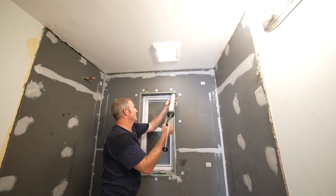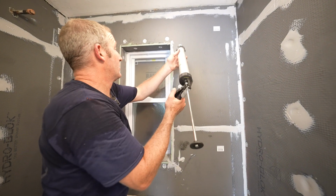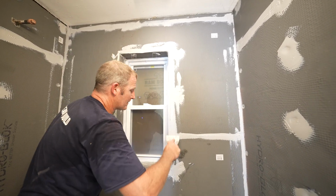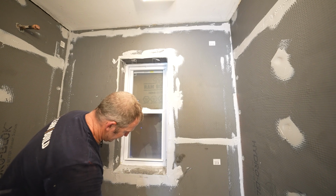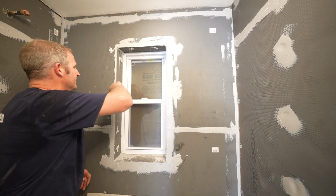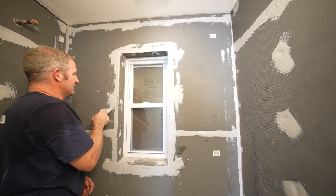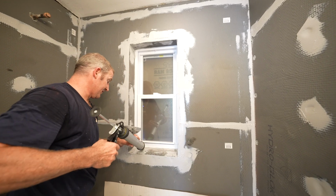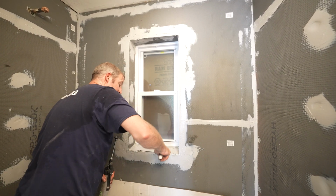Okay, so then around the window, just go across this entire seam. Make sure you get these little... And again, if you have any of this green exposed, it's not a big deal. Just know that the thin set will actually bond better to the sealant than the actual exposed green stuff here. So it is kind of better to completely cover it, but it's not necessary. It might not be a bad idea just to basically do this whole sill completely sealed surface here.